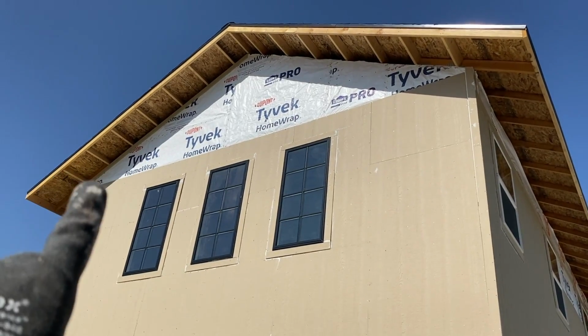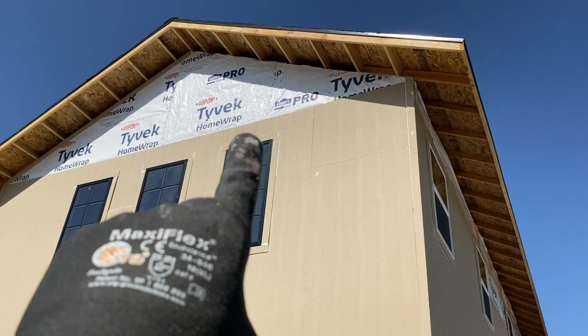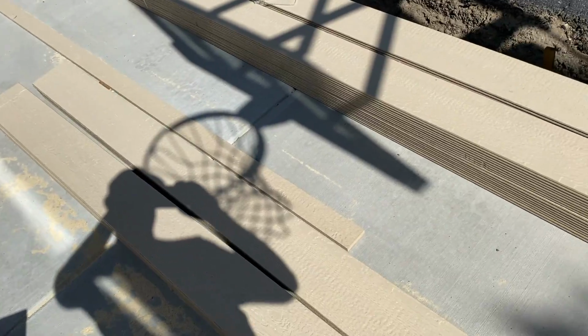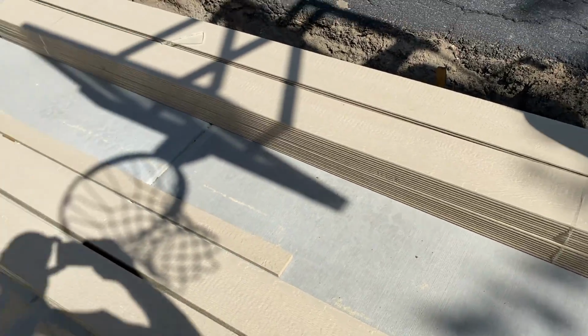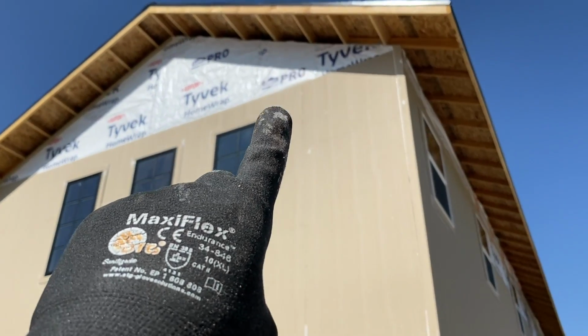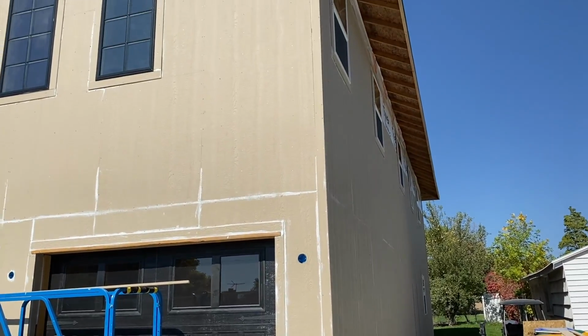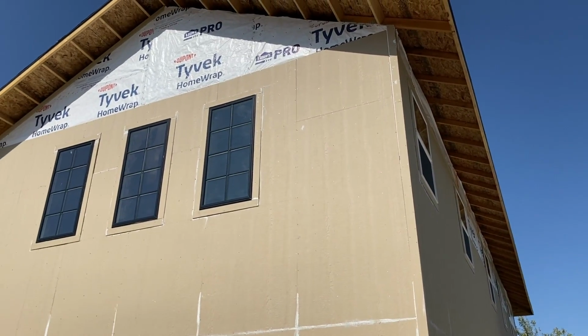Okay, so up there, we've got it sided all the way up to that point, but I've got to do lap siding, which are these pieces here that have to go in, and they'll sit up against the trim once I get that piece up in there. But this is all done down the side, and we're almost ready to finish putting on the battens.